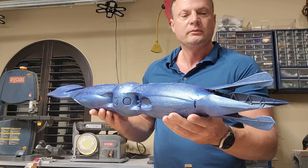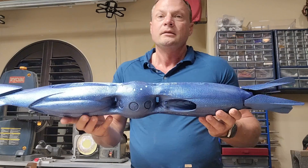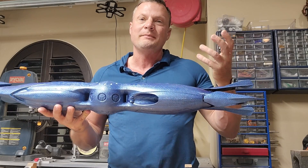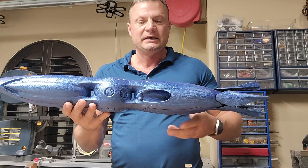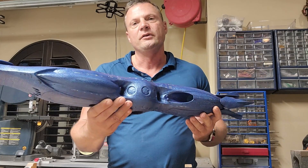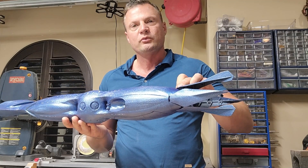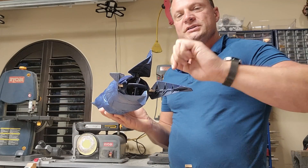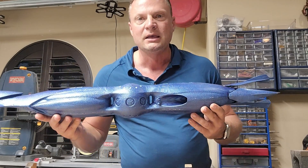In the back, we've got the rear engine that was modified for dive planes and rudders. The motor is inside this rear compartment, and as such it's pulling water from outside the boat. In order to make that happen, we needed to make a passage, and to that effect we made two large intakes on either side of the boat. It provides a large ingress for the water to get pushed through a rear bulkhead by a four-bladed brass prop, and then it washes over the control surfaces, which gives instantaneous reaction to pitch and yaw inputs.